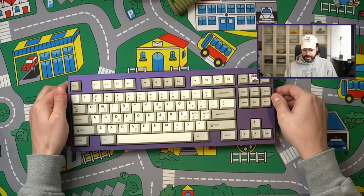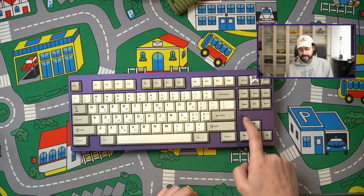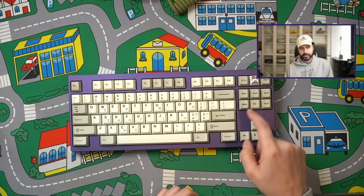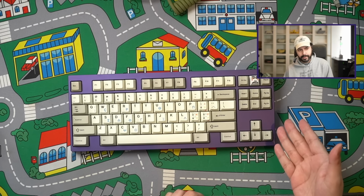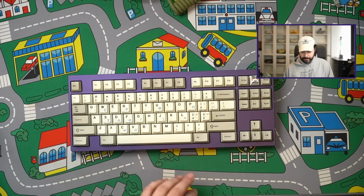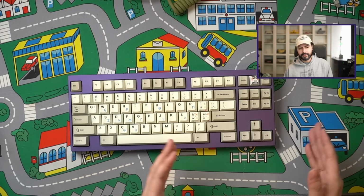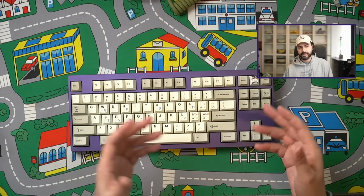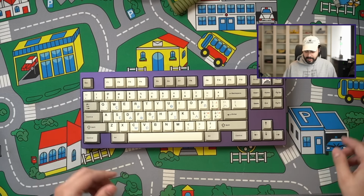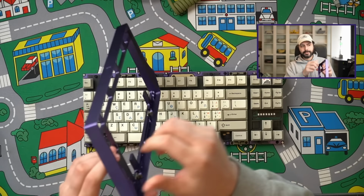And then here, the top, this is the simple variant. There are 2 variants. There is a variant that has the big LED ashtray looking thing, and there is the good looking one. If you prefer the LED one, go for it. Now, the LEDs are still there on the PCB, so once you build the board, you have to go into VIA and turn them off. All right, let's have a look at the inside. Boom, top comes right off.